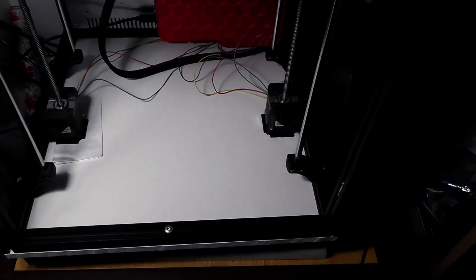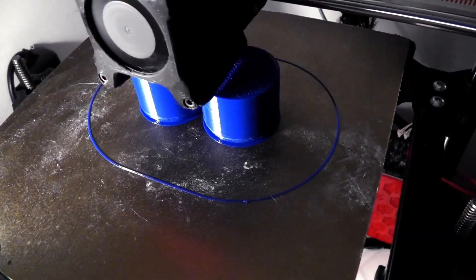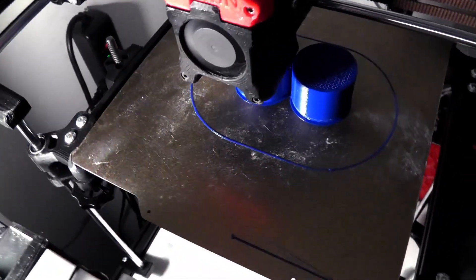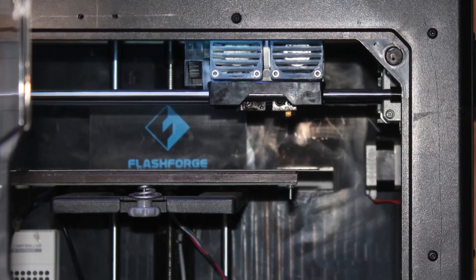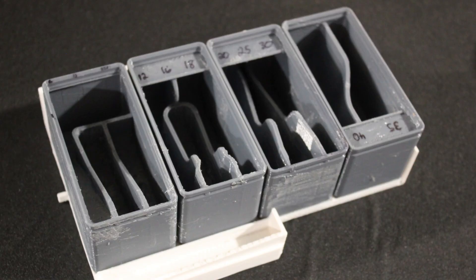The box said 320 millimeters, which don't exist, but the 300 millimeters reached the Z minimum. Now the finish is great — it definitely prints PETG better than any of my previous printers: the JG Aurora A3S, the MakerBot Replicator 2X, or the FlashForge Creator Pro 2016. I'm using the PETG settings recommended by the Prusa knowledge base and 0.6 millimeter first layer pathways.